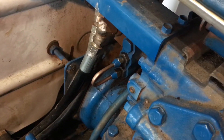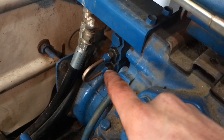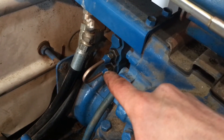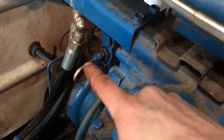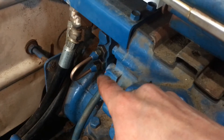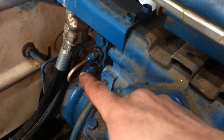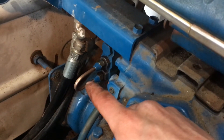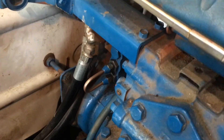The final thing I've addressed before the hydrostatic steering goes in is looping the original steering circuit. This went to the power-assisted recirculating ball gearbox — I looped it to itself so that send and return are now completing their own separate circuit. There were no standard hydraulic fittings that would work, so the only way was to have somebody put a copper line, use the old fittings, and bend that into a nice loop up out of the way. The new unit will take hydraulics either off the loader or off the main line, and when the kit arrives I'll figure that out. At this point it's just a waiting game.